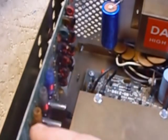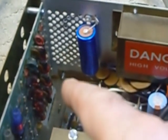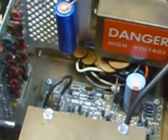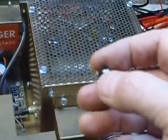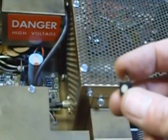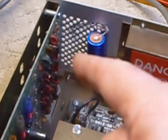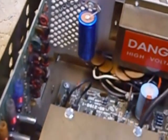Also, the 10 meter coils — the two toroids down there — there are two trimmer capacitors down in there. Those trimmer capacitors were these little black ones here. These are plastic and after a period of time they just stopped working or became very intermittent, cutting in and out. So I took those out and put in some ceramic ones I'd gotten at a hamfest — really good ones, two to eight picofarad.